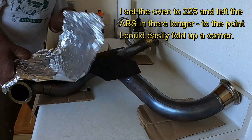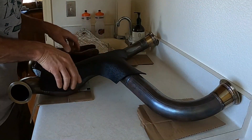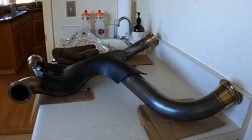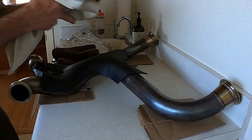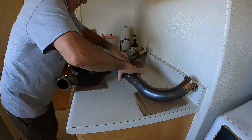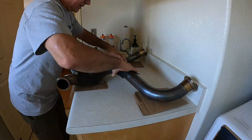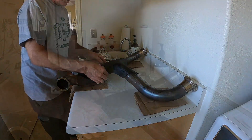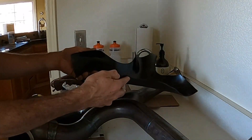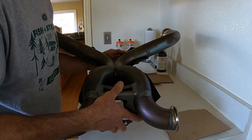I also got it hotter this time, so it's way more flexible. Look at that — that's what I'm talking about. This is the tricky one down here, and it's hot. But that's what I want. So if I can get the sandbag... There is one slumped ABS mold — oven mitts aside. It's still warm but it's not moving anymore. There's my mold. Forget the fact that this is off-center; I just hacked that out to get some more room to move. You can imagine that trimmed to shape — this part up here will get trimmed out, nicely evened up, and all that good stuff. That worked out wonderfully.